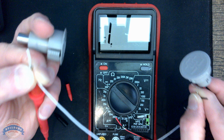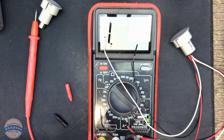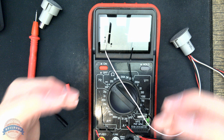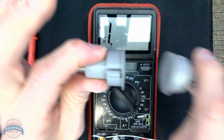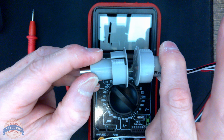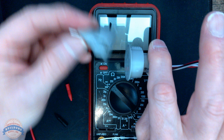you're going to send that off to the red, which will go into a circuit where there's power in the opposite condition. So if you're going to use both the red and the white leads, you're going to not be sending power in one instance and sending power in the other instance. Meaning, you're not going to be sending power when the door is closed, but you will when the door is open. No power sent here, power sent here. Power sent here, no power sent here.